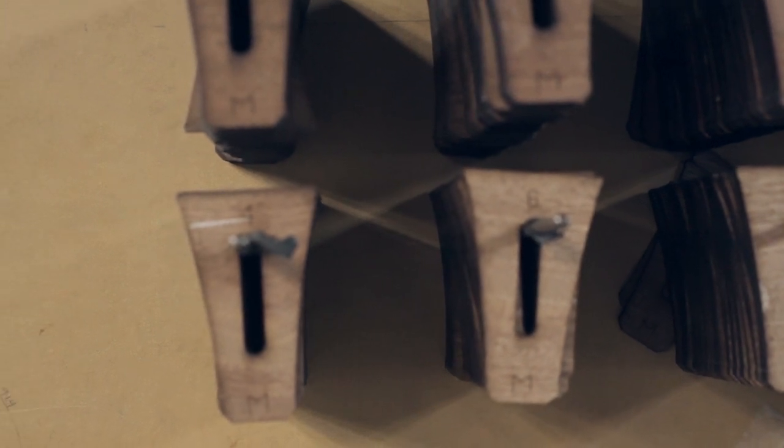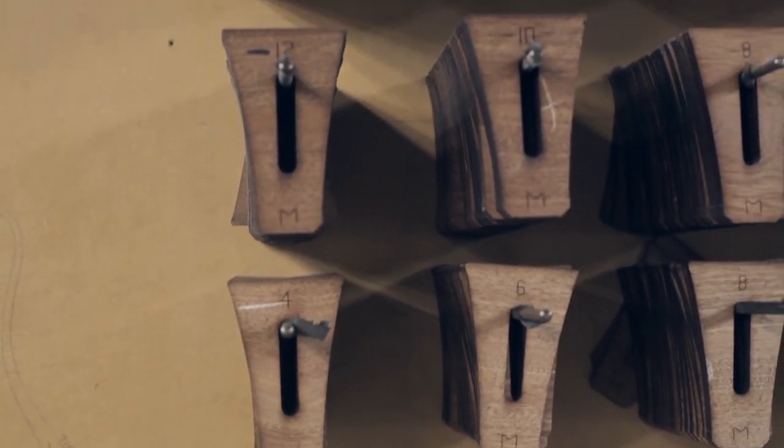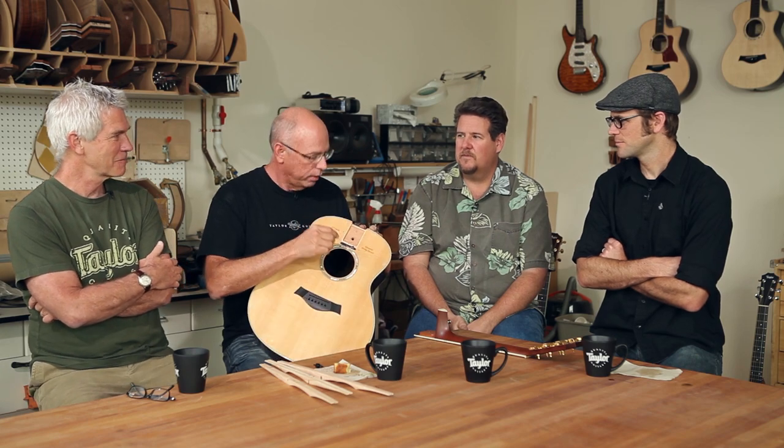This one has measured into it a negative six, meaning it's six thousandths of an inch — about two pieces of yellow pad paper — thinner on one end than the other. So it's more of a laser-milled spacer than a shim. It's a really precisely gauged angle adjustment mechanism. It's made out of wood, everything fits on there perfectly, and it transfers sound really, really well.